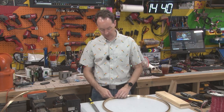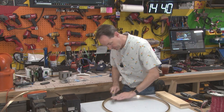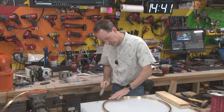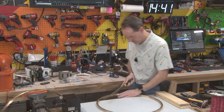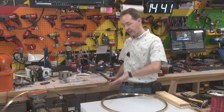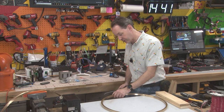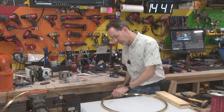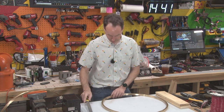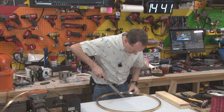That — there are some things you can notice with your finger. Oh my God, we're going to remove some material there. And it's important to not — I can file all I want on the sides and the edges. Don't file on the outer circumference unless it's to just barely remove any high spot pokey spots, because if you put a flat spot on there you're going to cause problems for the brushes. Wow, on the other side too.